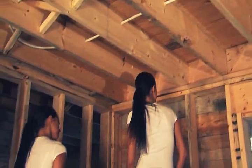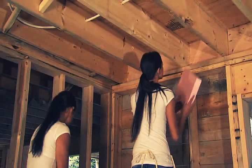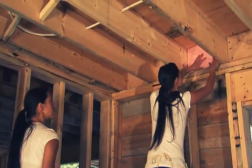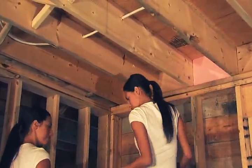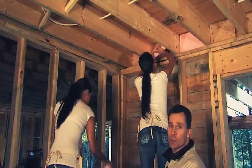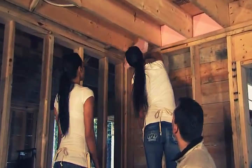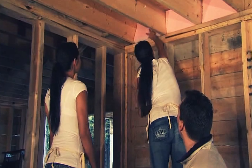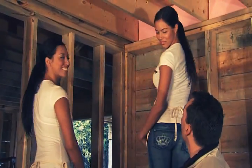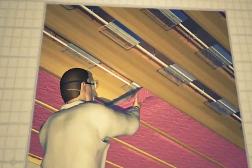When insulating your rim joists, McDuffco recommends using Styrofoam insulation pre-cut to fit each space. Once you've got your Styrofoam pieces cut, it's a simple matter to snug fit them in against the rim joists. If you do have any gaps, you can fill them in later with some spray foam insulation. Once you've insulated the rim joists, you insulate the entire system from underneath, and you're ready for wallboard.